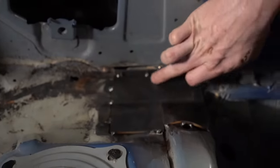Look at the chassis that you're doing a roll cage in and analyze the area that you're choosing, because whenever you do roll over, all that load has to be able to be distributed throughout the car in an area that isn't going to tear, which in the 350, this is the perfect spot.